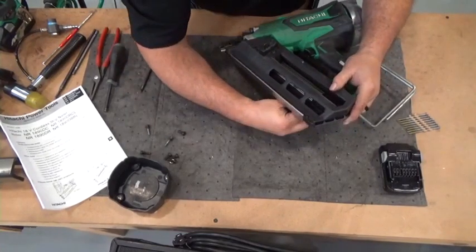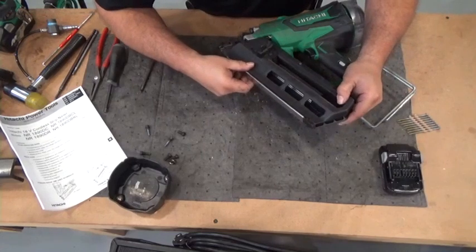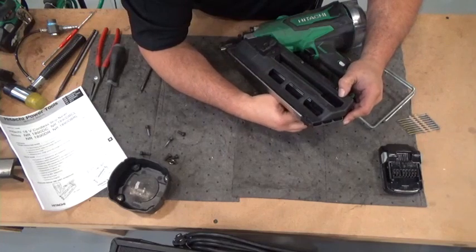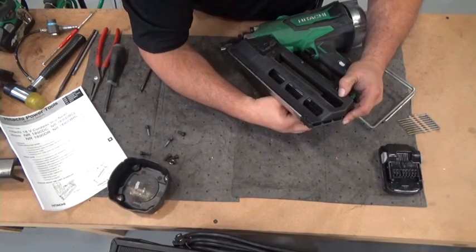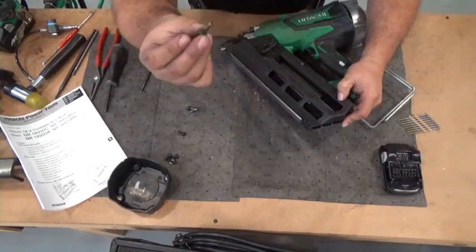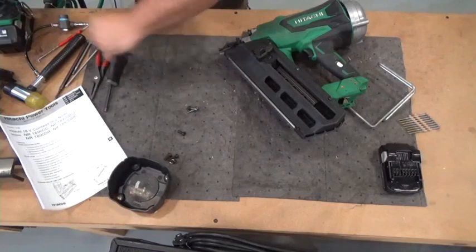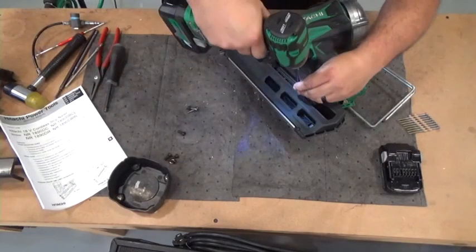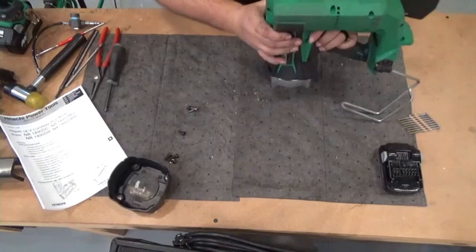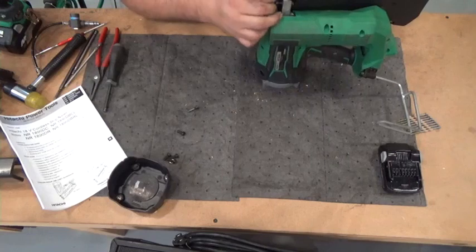I'm gonna put the spacer in there, line it up with the hole, carefully put this on here without messing up that spacer. That spacer's gotta go back in there, so don't forget it. So that's that one. A little bit of blue Loctite. Oop, gotta switch over to the number four. 4mm for these bolts. I'm gonna put that in there just so it's a little loose, so I can have some playroom with the front here. Blue Loctite. Not a whole bunch, just a little dab will do you.